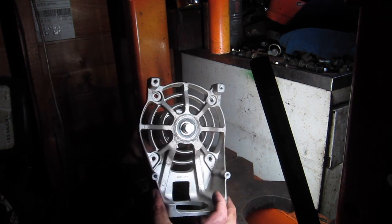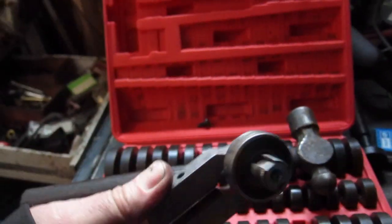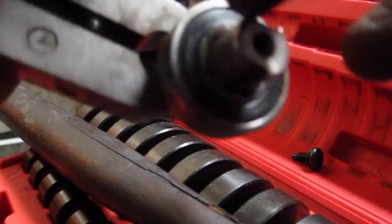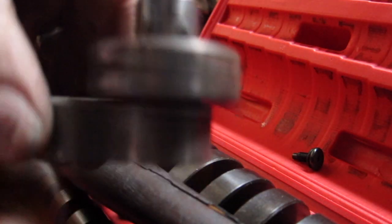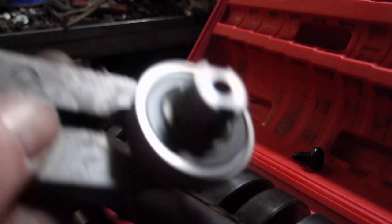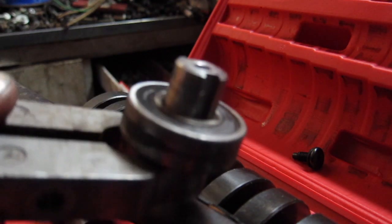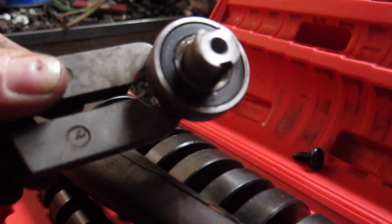Now I'm going to go put this compressor back together. Now here's that little crankshaft eccentric there. Now the bearing on the electric motor was fine, but this one here, take a listen. Sounds like a metal roller skate. So that one's got to go. We're definitely going to change that because it'll just be a matter of time, and that one will grenade next. And so, got it up hot, might as well do it.